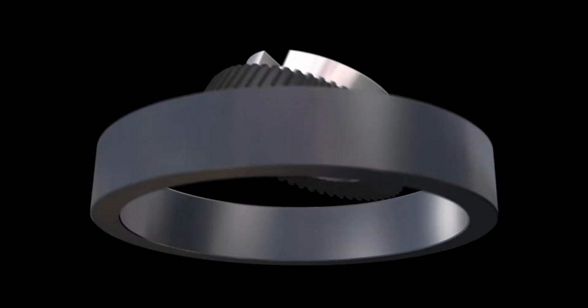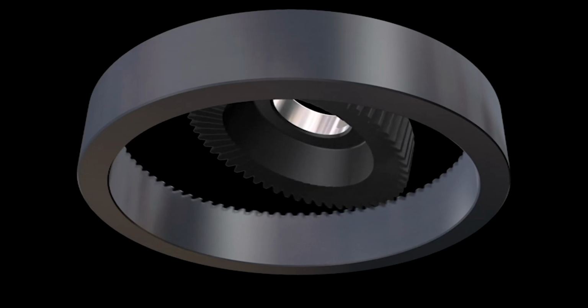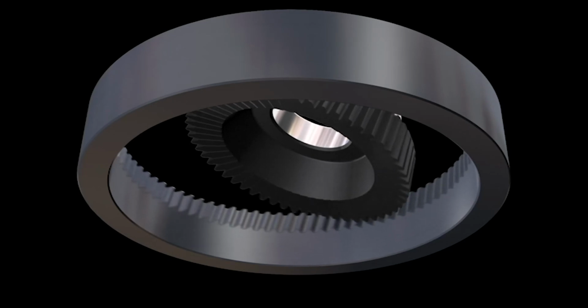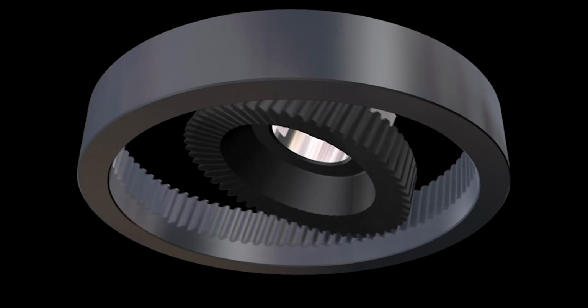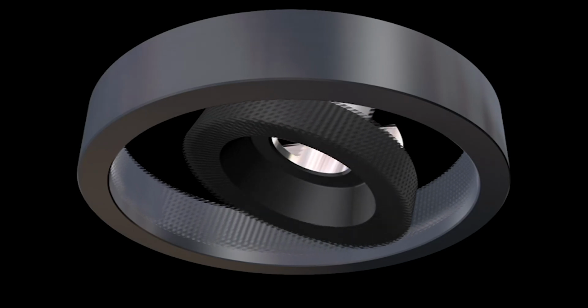Skiving is a gear cutting method that involves the setting of a pinion-shaped cutter at a cross-axial angle and then moving it along the axis of the workpiece. There are 2 advantages. 1, work can be much more efficient than gear shaping. 2, tooth leads can be changed by program.